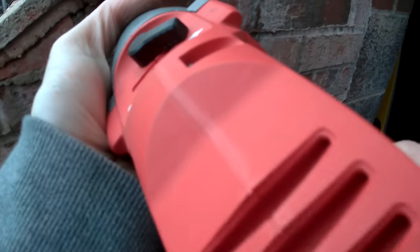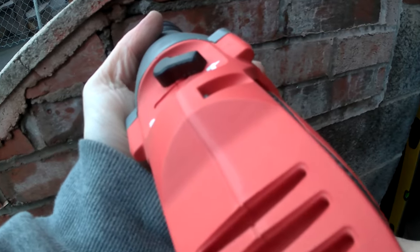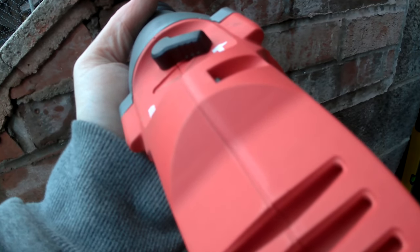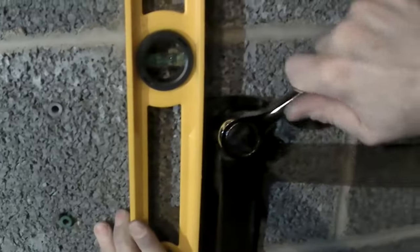Make sure to clear the debris every now and then, and slow down — these bits can get pretty hot. Once you clear out the debris and the dust, do the same for as many holes as you need to drill. Then put it up. I don't recommend an impact driver; just use a regular driver or a socket wrench to install the Tapcons.